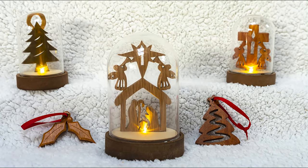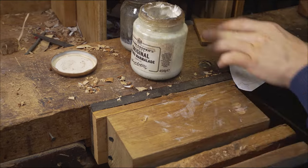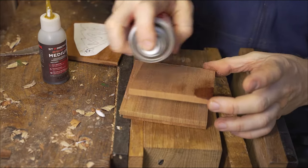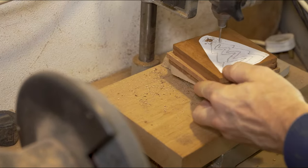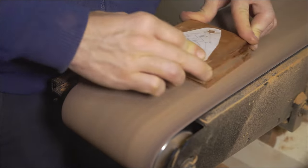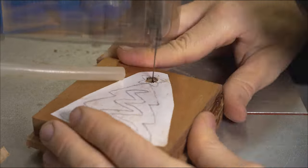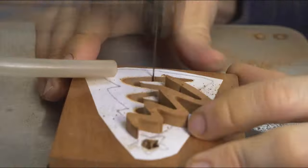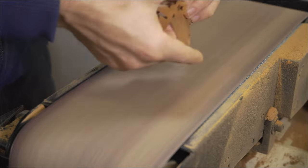The final item is within a category that sells very well here at our family workshop - anything to do with Christmas. The chosen product is a hanging Christmas tree decoration. We start by preparing the wood and the designs, stack a few layers together, drill holes for the pierce work, and sand the design nice and flat on the back. Our recommended cutting process is to do the pierce work and internal holes first - cutting out on the inside of the star - then cut the line that creates the tinsel effect, and finally cut the outline. Separate the layers, sand them smooth on the belt sander, and add your chosen finish.